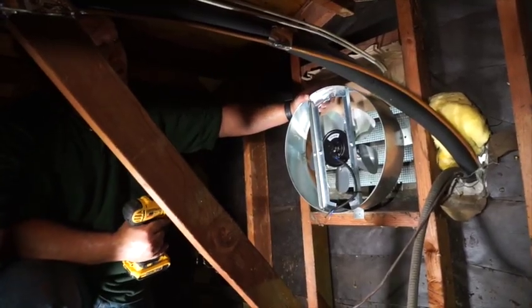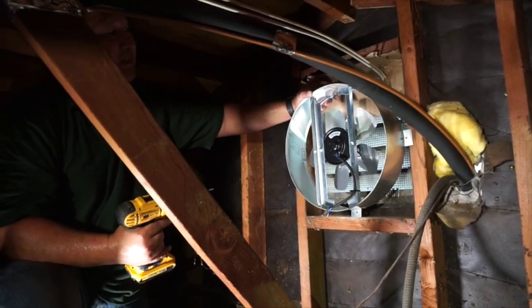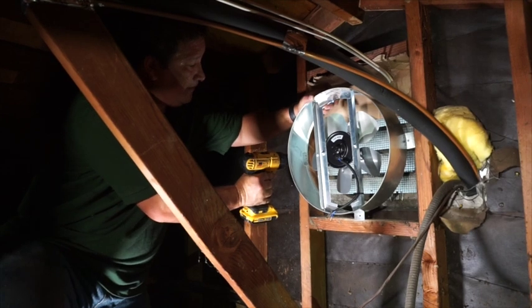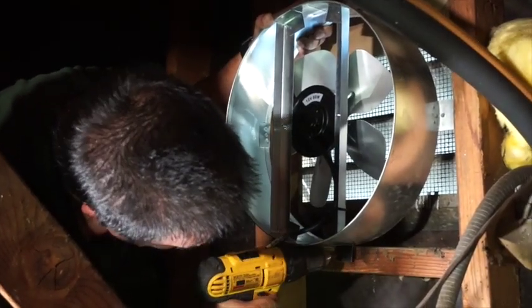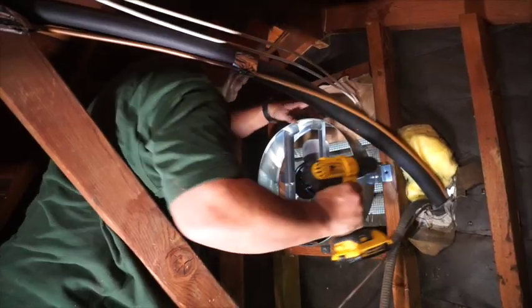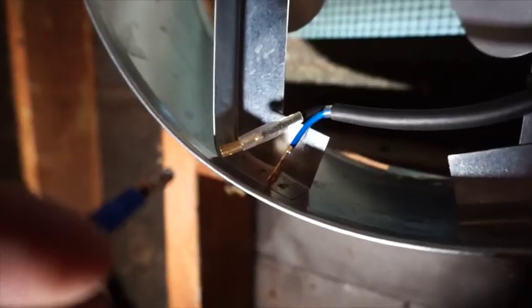As you can see, we're ready to install the fan. It's a natural fit between most dimensions for the attic vent, so you're just going to take up the space in that gap with some simple cardboard. Push it up and fit it into the gap and plug it up. Nice and solid. Now we're going to go ahead and wire this up and get the wire through the roof to go to the solar panel.